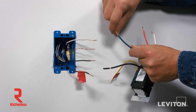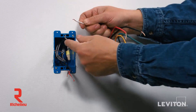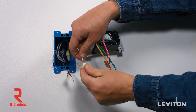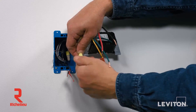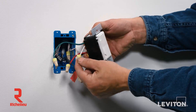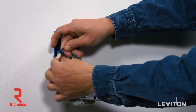Make sure that the ends of the wires from the wall box are straight and stripped approximately 5/8 of an inch. If not, you may need to cut them. Hold firmly on the conductor coming out of the wall box together with the exposed conductor of the device's pigtail and twist in a clockwise direction. With the conductors twisted and mated together, insert them into a properly sized wire connector and twist the connector until the conductors bottom out inside and can't be twisted further. The wires are now terminated. Give the wires a tug to ensure they are firmly held in the wire connector.